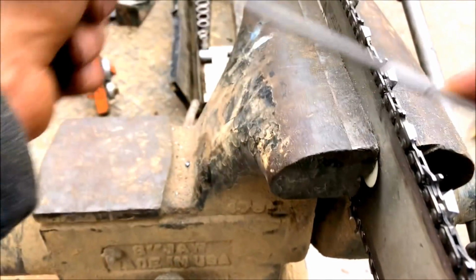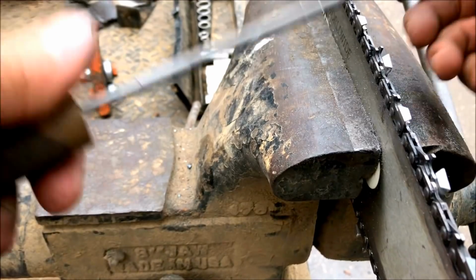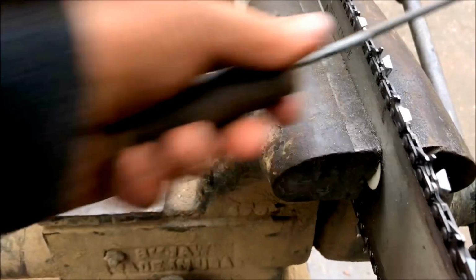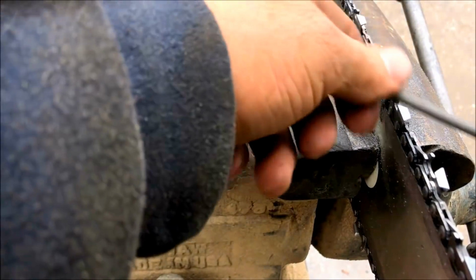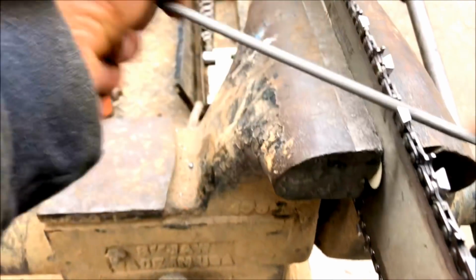The other advice I'd give a young buck getting out there and starting to production cut: I always carried two saws ready to roll in my truck at all times when I was cutting a decent amount. Don't wait till the next morning to get your stuff right. Every evening before you go home, get that saw right. Get it to where you're ready to grab it out of the truck full of fuel next morning, jump off the skidder and start whacking. It just makes your day go better. Get yourself warmed up early in the morning and going.